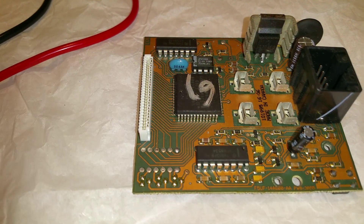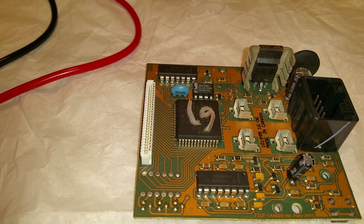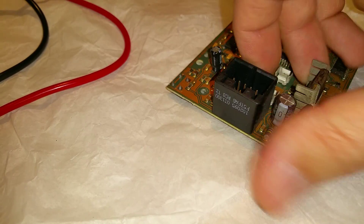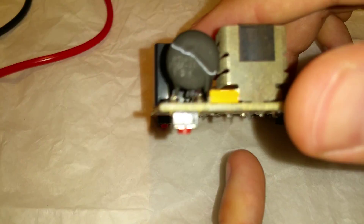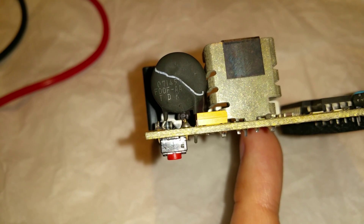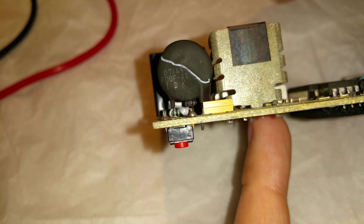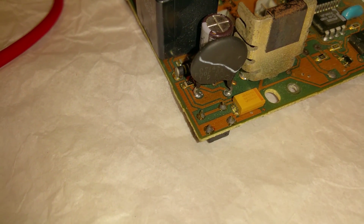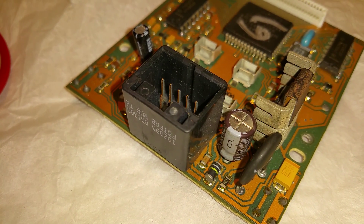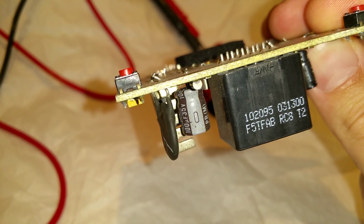There's a socketed chip that appears to be Ford proprietary — if those burn out, you pretty much have no recourse but to order a new one. The hardest part for me was finding the varistor — it's an MOV, a metal oxide varistor that starts conducting after a certain voltage to protect the circuitry. The TDK part number I found may be a date code, and it was likely special-ordered by Ford. Normally you'd find that the varistor is either exploded or the trace underneath is destroyed. The electrolytic capacitors have been in service since 1995, so they're likely all dried out.